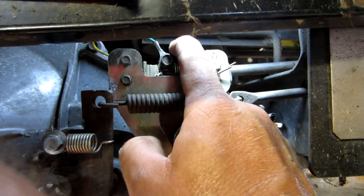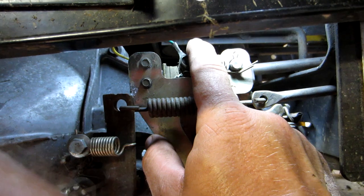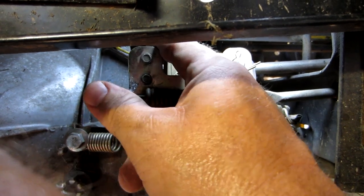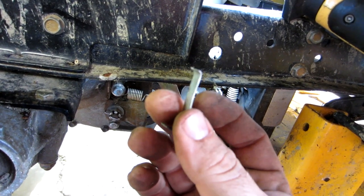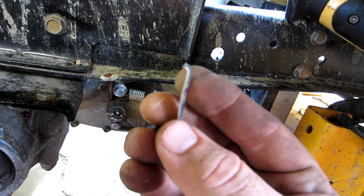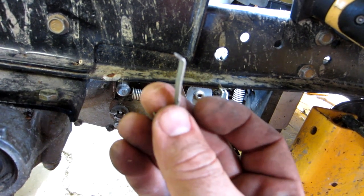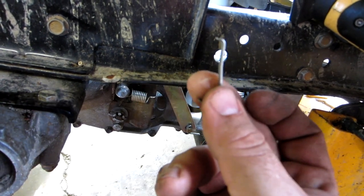So what you want to do — and this is on your own, I accept no responsibility for your actions on this — you want to remove these two quarter-inch screws and break that tab off of the switch and then reinstall it. Here's what that tab looks like and you can see it's broken off on the top here. This is the part that would ground and turn off the PTO if you tried to mow in reverse with the PTO on. Now that this is removed it can't touch the ground.